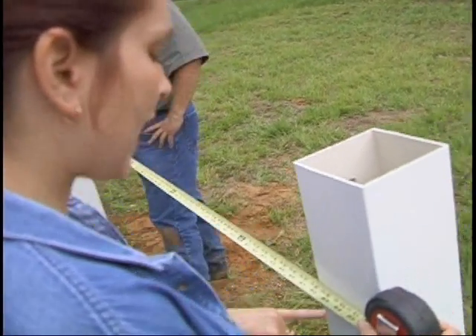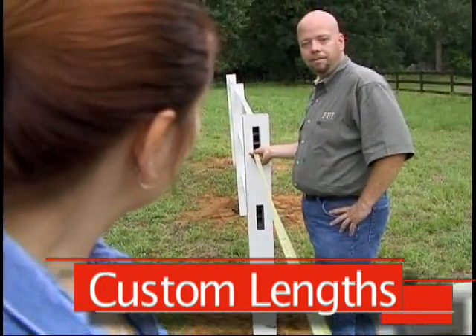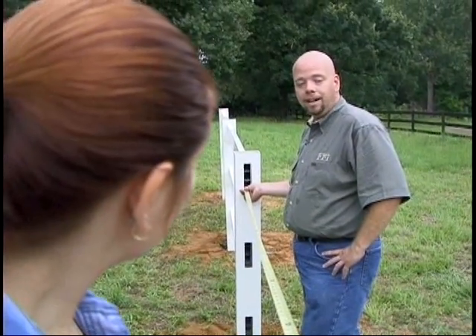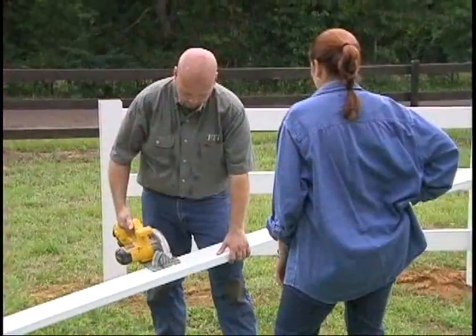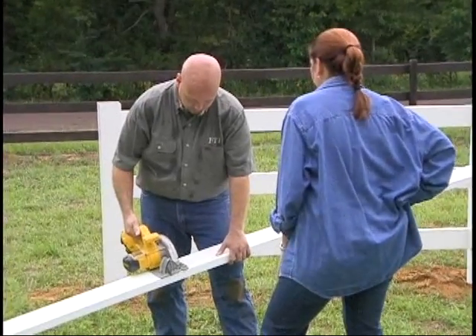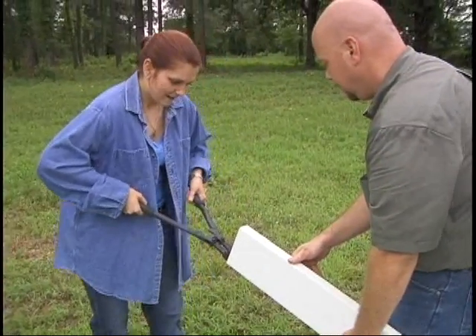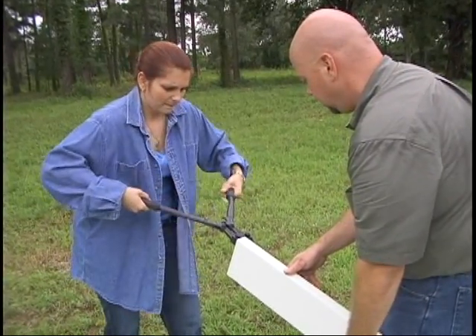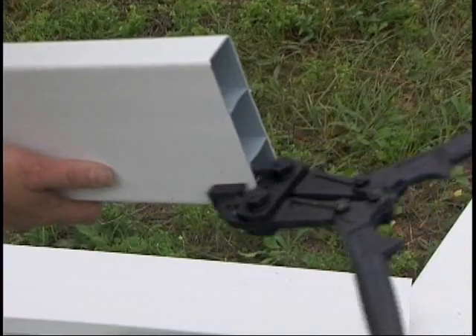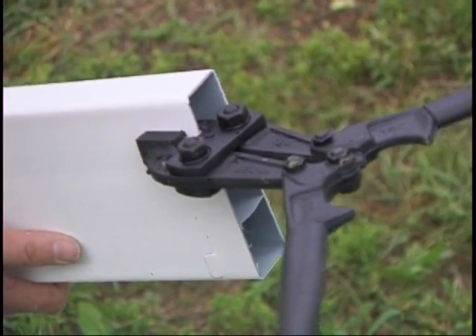Richard, this last gap is 94 inches and our rails are 16 feet — what do we do? That's okay. We'll just take one of our 16-foot rails, cut it down with a cordless skill saw, and re-notch it so we can use it here. Let's get to it. Perfect. Now we're ready to install.